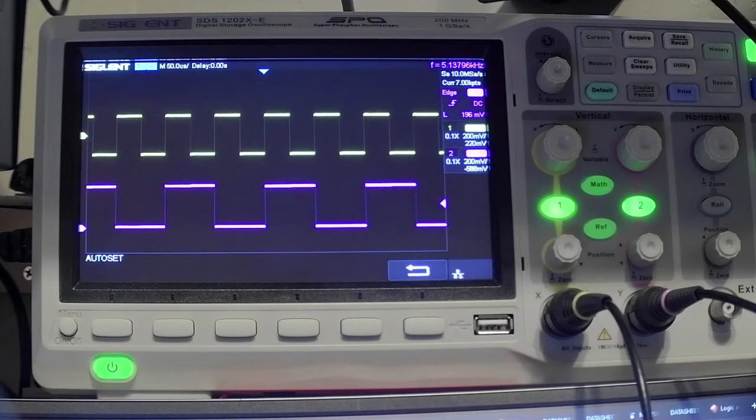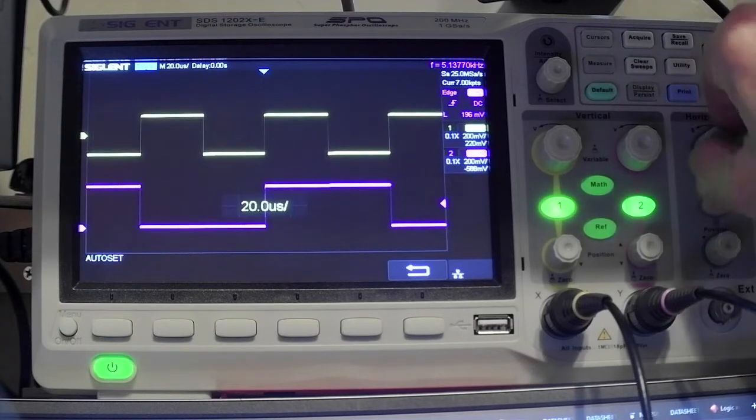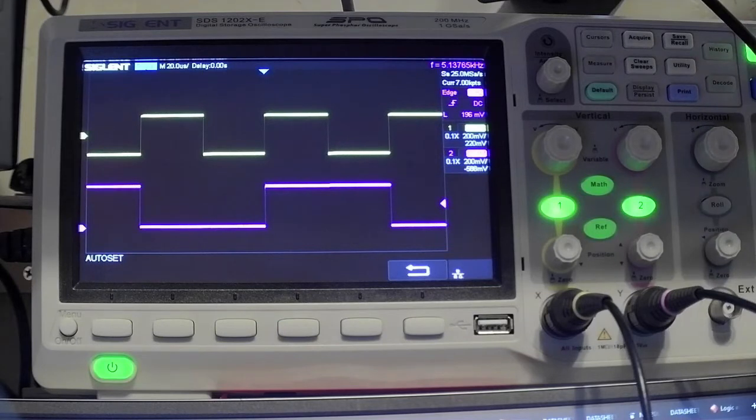Anyway, what we have here is, even if you had an oscilloscope with 4 traces or more, it's still not quite as convenient, as you will see, as having a logic analyzer, because in order for me to know if there's any offset between those traces, you would have to adjust the time base, and if you want to know the timing of the signals, you'd have to set up some cursors and tell it to measure between those cursors. Of course, if you've got an old-fashioned CRT-based oscilloscope, you probably don't even have those facilities. You have to do it by eye. So let's switch to the logic analyzer output.